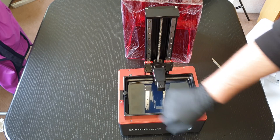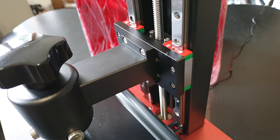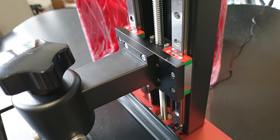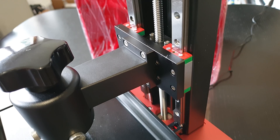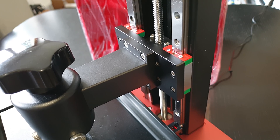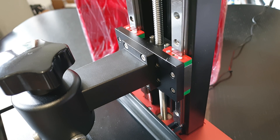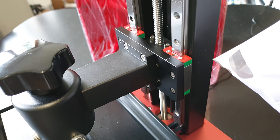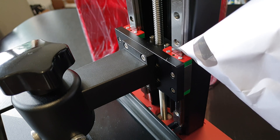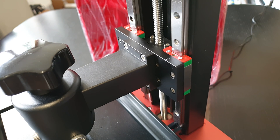The only sources of distortion we are going to experience with this one are the unavoidable material shrinkage and the movement involved in layer changes. That's why masked SLA is my personal favorite at the moment, probably until micro mirror DLP becomes available. Are those genuine HiWin rails? Probably not, because there's no laser engraving, but they do look nice — got to give them that.